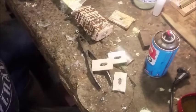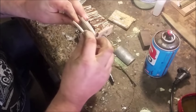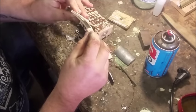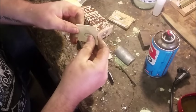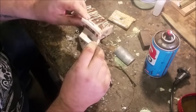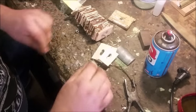I've prepared three extra pieces and tapered them all on the grinder. You can use a skiving tool to do this — a skiving tool is basically just a very thin blade and you can shave it off using that. But we're in the workshop so I use the grinder. Just do that carefully — don't grind your fingertips.